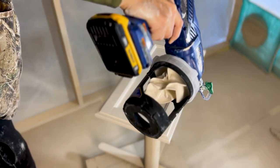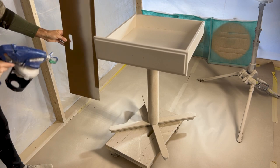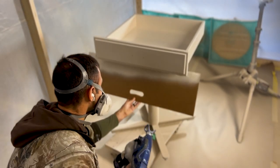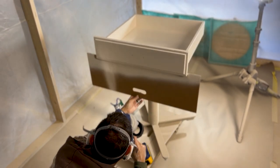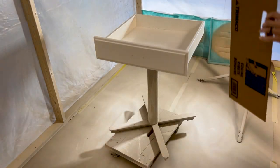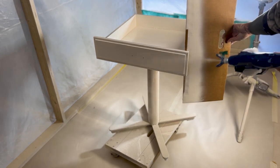After finishing the doors and drawers, I went to help the painters do the face frames. They did the spraying and priming on all of that, so I mostly helped with sanding and similar tasks. It's kind of the same process but a little harder since you're working in someone's house and have to mask everything off. You just need to make sure you have adequate airflow and are very careful with your masking.